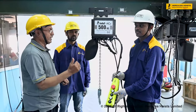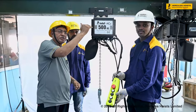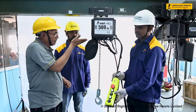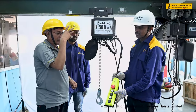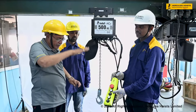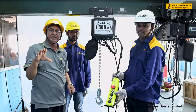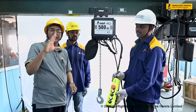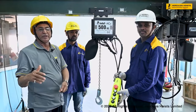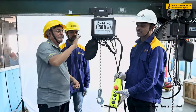The next step is to check the limit switches — both the top limit switch and the bottom limit switch. When pressing up and the lower block rises, the gear rotary limit switch should actuate, confirming the upper limit switch is working. When the block reaches the lowermost position, the lower limit switch actuates, confirming the gear rotary limit switch is set properly. If less height of lift is required, adjust the gear rotary limit switch accordingly.